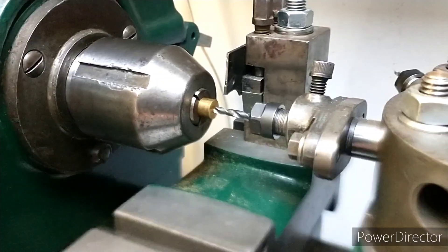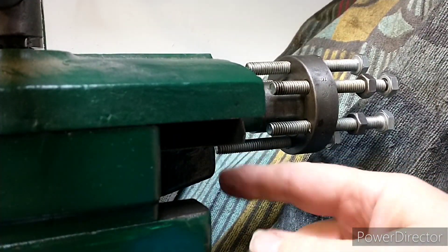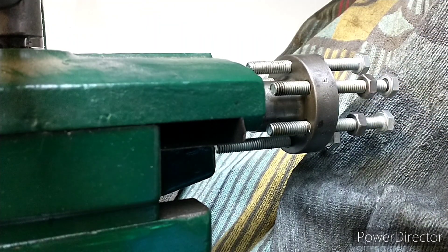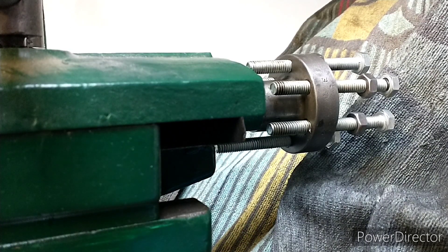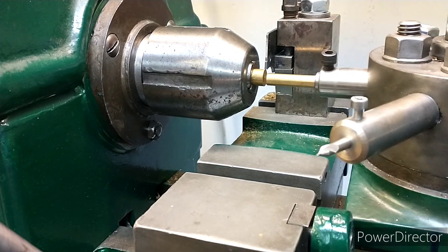If I bring you round to the limits, what I've done is made this gap here a quarter of an inch. There's one of these for each tool position and they set how far this part moves into the work. I think we're ready to give everything a try now, so let's see what happens. That's first position — I'm going to apply a bit of pressure to the workpiece and start the motor.